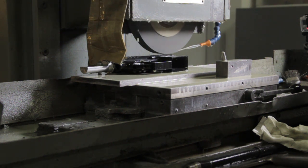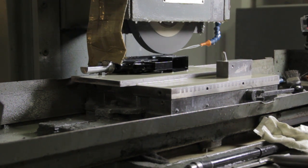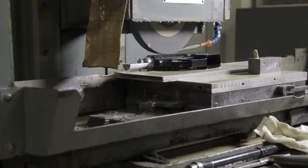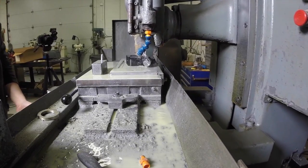Now we can move on to the receivers themselves. Testing for high spots as we lower the grinding wheel down two thousandths with each pass until it makes contact. Then we'll gradually take off a little less than a thousandth of material with each pass adjustment, working down until we reach bare, clean aluminum across all the surfaces we are working on.